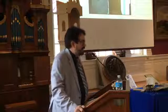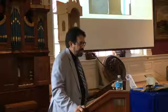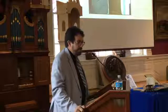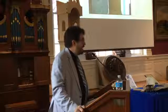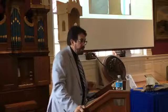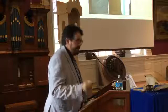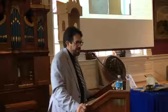But the problem is that you need to maintain the finish on these clocks in every collection, wherever they may be, because what's happening is it keeps the ambient air with moisture off the wood and off the veneer, off the inlay. So the shellac serves multiple purposes of enhancing the wood by making it look wet, protection, but it keeps that ambient air flow out. And remember, back in the 18th century, when these clocks in the museum were in homes, you didn't have this up and down, let's, honey, turn the heat on, and the heat comes on, and it's blowing across the room, and the panel starts shrinking and cracking. I mean, these guys are pretty durable. Wood is such a durable item.